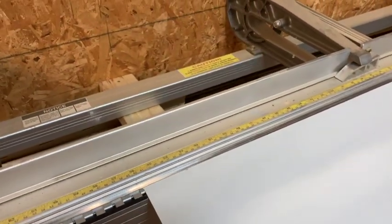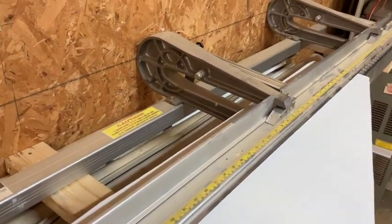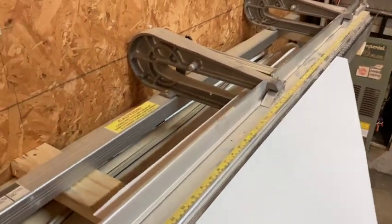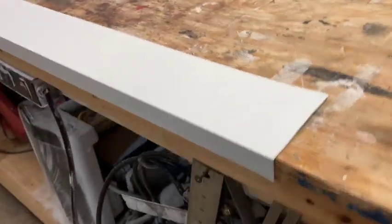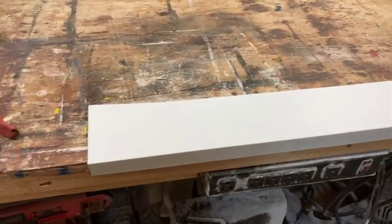It's been my experience that typically there's quite a bit of water damage when we take the old door out. We'll have to rebuild the subfloor before we set the door, and then I always flash it. And of course, we still use silicone and caulk it all in. So if this is the threshold or the subfloor under the door right here, you can see this part would just bend down over the siding a little bit and provides a little bit of weatherproofing. And then we will tape up the sides with zip tape and come down over.